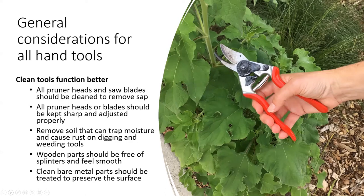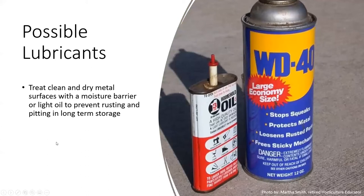There can be quite a bit of debate about what you use to lubricate with. I've suggested WD-40 as a product in the past and been told by machinists, well, that might work, but it's really not a true oil. Well, my point in all of that is, we're not talking about your car engine or the lawnmower engine. We're talking about just a plain flat surface. And WD-40 does a good job of keeping the moisture off that metal surface. So WD-40 works. If you really want an oil, something like a 3-in-1, some household oil, maybe something the equivalent of what's called a sewing machine oil works.